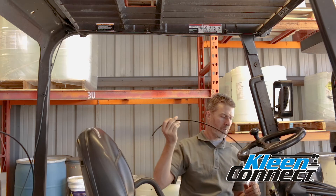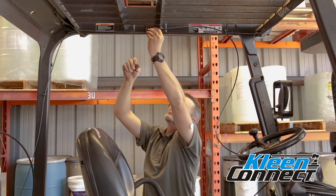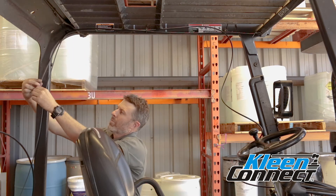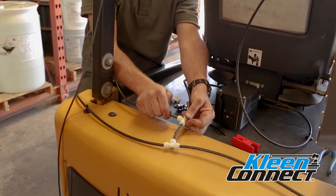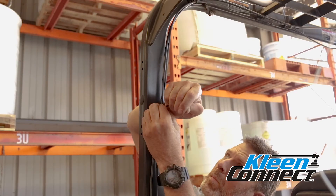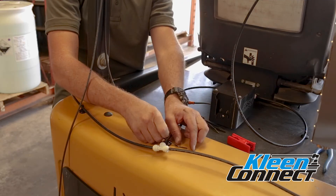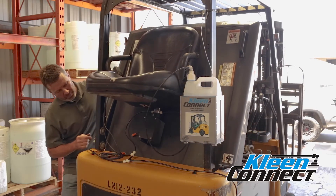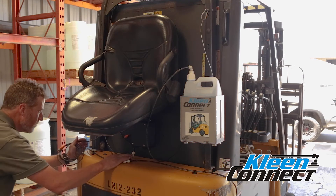Starting at the front of the lift, route the chemical tubing through the plastic ties that were loosely secured to hold the photosensor cable. Route the tubing back to the pumping module location and connect to the remaining open end of the first tee installed. Now you may finish tightening the plastic ties to secure both the photosensor cable and the chemical tubing. Using one of the plastic ties and magnets, secure this tee to the counterweight of the forklift. Before proceeding to the front nozzle assemblies, lift the forklift seat or cover to ensure that the chemical tubing, sensor cable, and fittings will not be damaged.